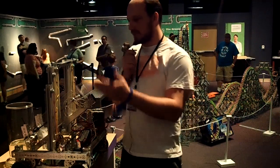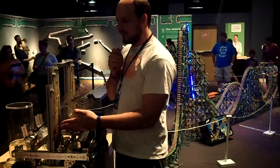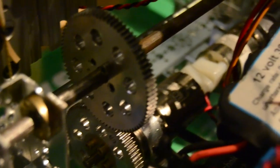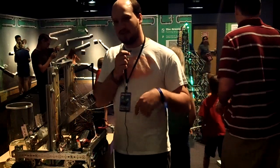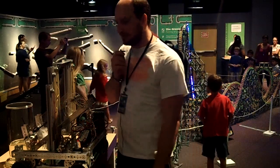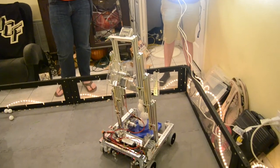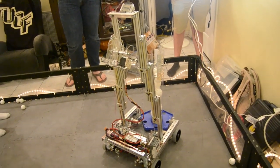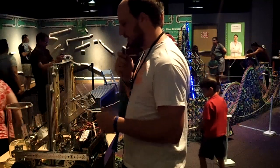It works off of a cascaded cable, meaning the only section that's actually powered is the first section. The first section gets lifted up by a shaft synchronized across between the two gears — we're using a one-to-one ratio. This is the first failure point: the shaft actually got bent from all the torque on it. If you notice in the video, it grinds as it goes up because the shaft bent through all the use during the demo. It needs a support in the center, or some way to keep the shaft more true when it spins.